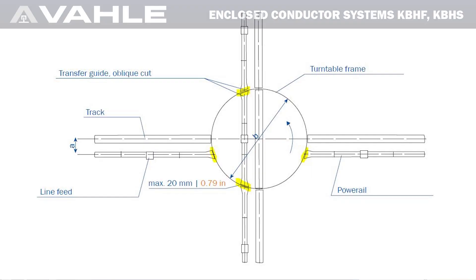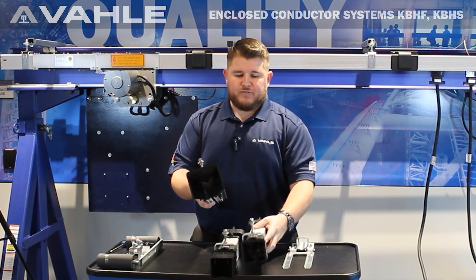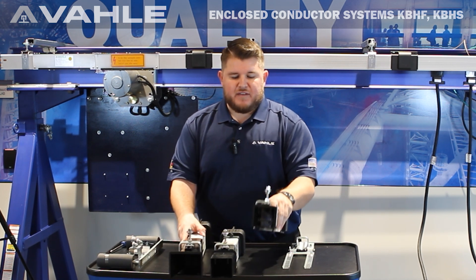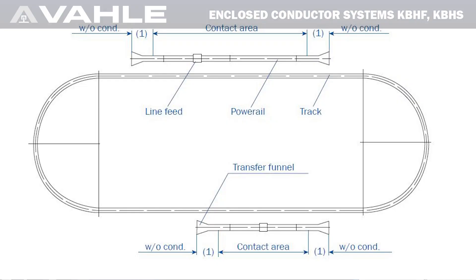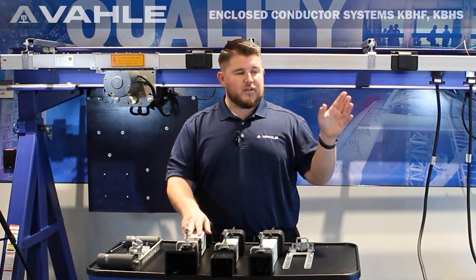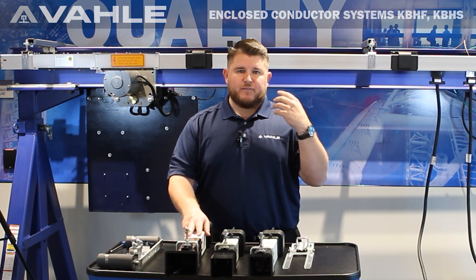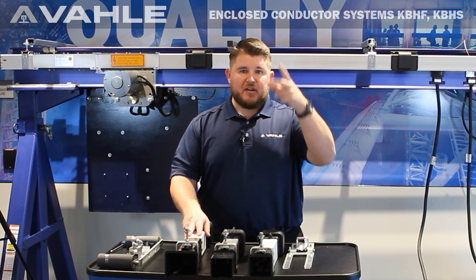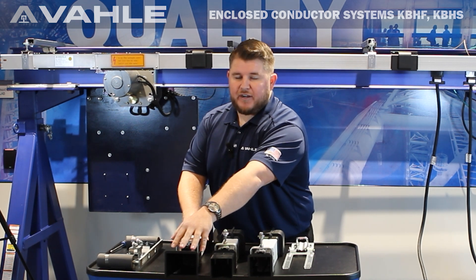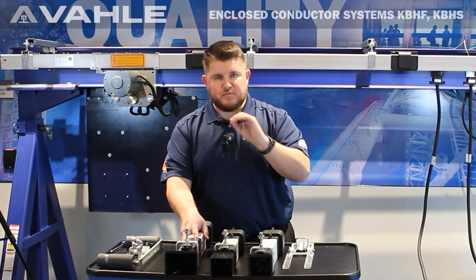The next one is going to be our funnels. As you can see, this is way wider. This one doesn't have a floor on there, and then this one does have a floor. This one is for whenever your collector is going to be completely leaving out of the system. So if you have a system where forklifts are going down aisles doing opportunity charging and coming back in and out — when that forklift goes to a destination outside the aisle, it will have a collector that is held up. When it comes back in, this wide flange makes sure that collector gets in there, centered, and properly tracks through to make a smooth transition.